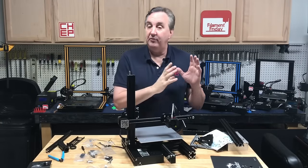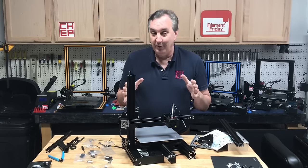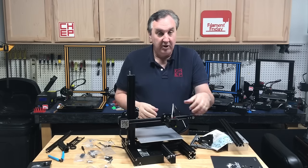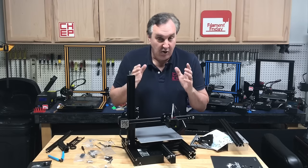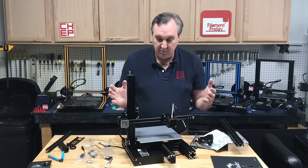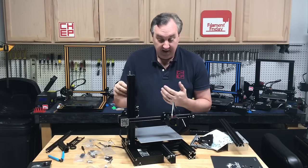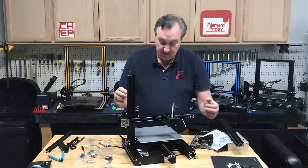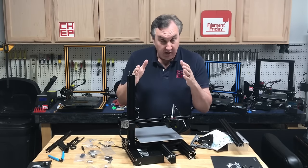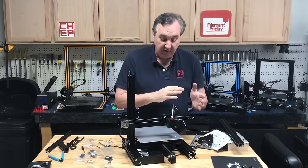You may be wondering why I took you through these steps out of manual order — it's because I wanted to get you here. This is really the core of your 3D printer. You've got your upright which is perfectly perpendicular, the arm is perfectly level, and it's even with the bed. Get this portion right and everything else is just support. This is like an Ender 2 with an articulating arm — you could almost print with it as-is. But we will add the other parts; that's why I wanted to assemble it this way so these parts are perfectly square.